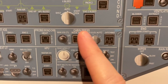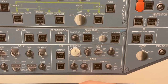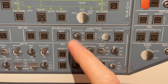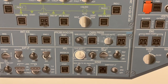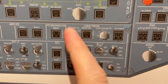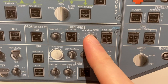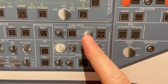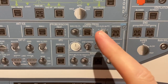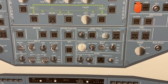This is to control cabin pressure — usually it's fully automatic. However if we do need to go into manual mode, we can select it there. We can open and close the outflow valve, allowing air to exit, depressurizing the aircraft. In semi-manual mode, we can set the elevation we'll be landing at and the computer will adjust the depressurization accordingly as we approach. We usually just keep it in auto and the system does it all by itself.